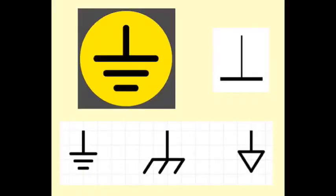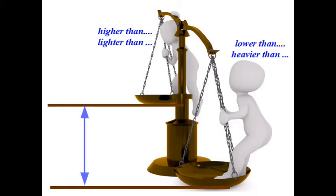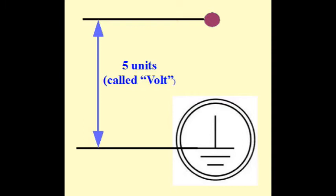Electrical ground. I know that a lot of you like some basic explanations, so let me shortly explain the basics of electrical ground. When we talk about voltage and volt, we tend to be quite inaccurate, because the term always means voltage between 2 points, between 2 electrical potentials. When we say, read or write things like, the signal strength is plus 5 volt, then we leave out the second part of the information, which is plus 5 volts compared to, yes, compared to what? Well, compared to electrical ground.